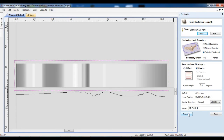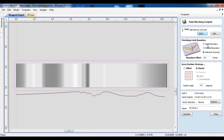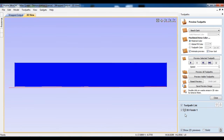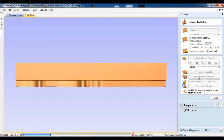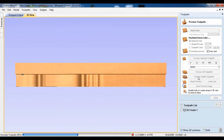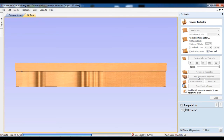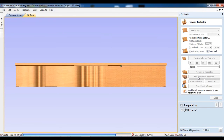I'm going to raster, not offset, so I'll click calculate. I'm using an eighth inch end mill — I need a ball nose — so let's do an eighth inch ball nose. I click OK, and now I'll calculate. Let's see what we have here — we'll preview our visible toolpath. And when it's finished, we should have a nice smooth cut. Almost finished. And there we have it.